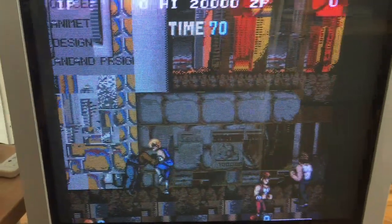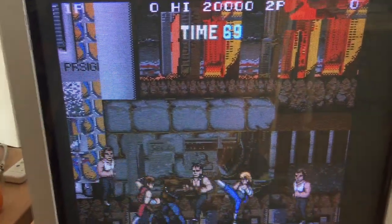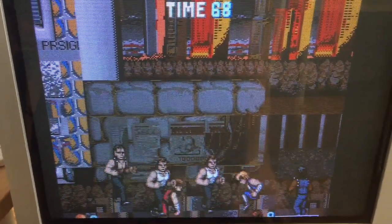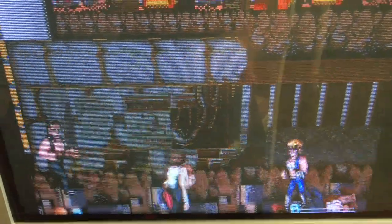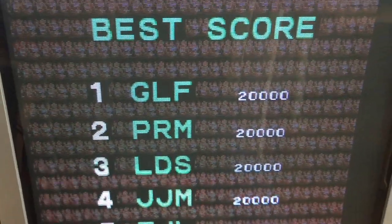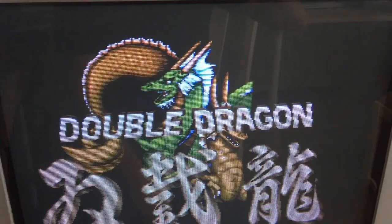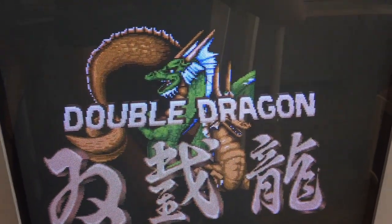Okay, and looking at the game when it's running, you can immediately see what the problem is. The graphical background of the game seems to be messed up, and the game is actually running. It's running fine, the sound is okay. You can actually see the characters, which are completely normal. Also the text overlays up here appear to be normal, but there seems to be something going on with the background graphics, like you could see just on this high score screen, with a brown background, which would normally be just black.